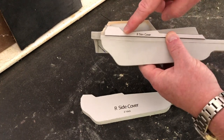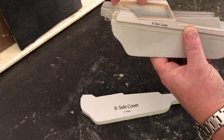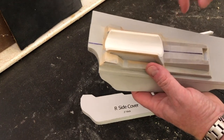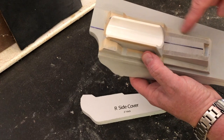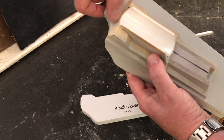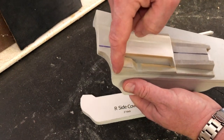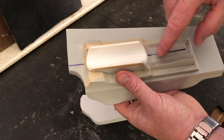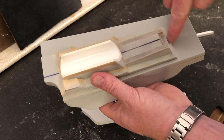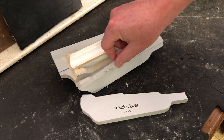Part of this is because of the way I put this together. Dealing with the back end I was fairly loose when I did it. Since then I've added a second deck line that runs across here as well as the center line, so on the template there's a line that runs across where you're going to line up everything. You'll go ahead and line everything up to the back, then add the front part flush with that - just push this up against that part and wherever this ends will be where it's supposed to end. Unfortunately that still leaves me with this piece here.